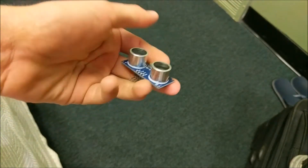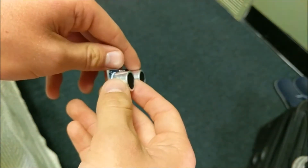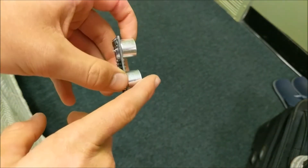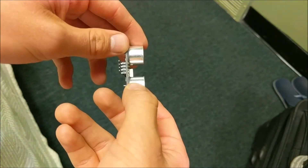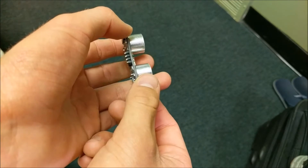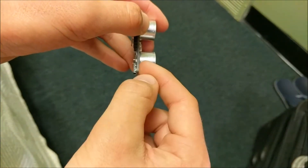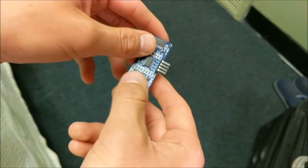How you calculate the distance is by using the speed of sound. We know the speed of sound is 340 meters per second. So if we have the signal going out and back, then we know that that total time divided by two is how long it takes the sound to reach the wall. And since we know it travels at 340 meters per second, we can easily calculate the distance based on the time it takes for the signal to travel out of the piezoelectric transducer and back into the other one.